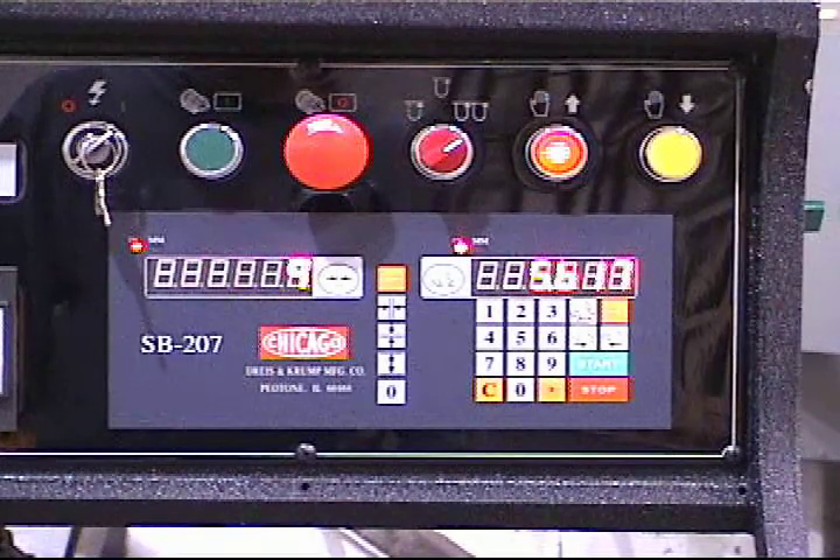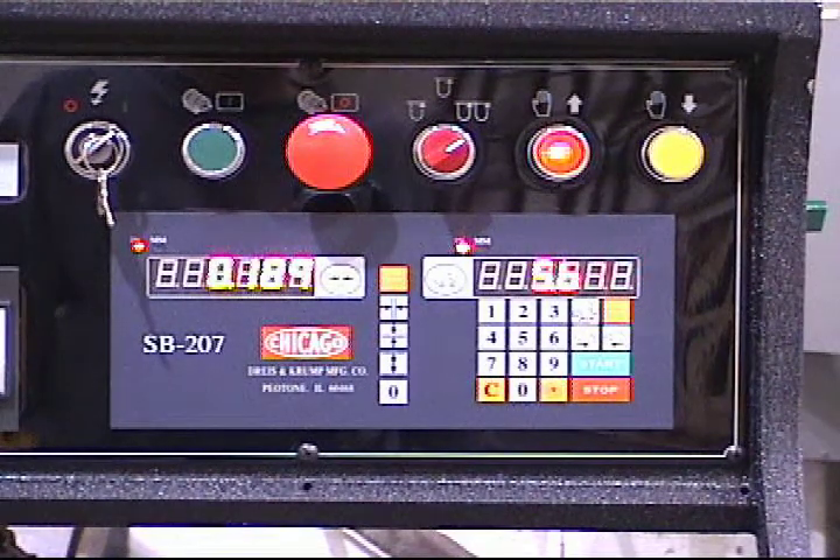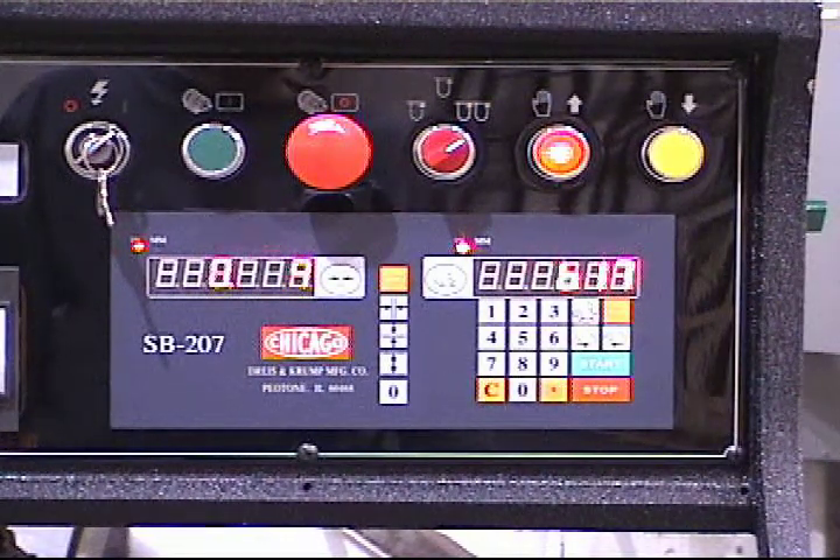On the left side, 0.189 — right now is your blade gap readout, which displays what your positioning is for your gap. On the right side is your back gauge position. It's got go-to positioning, and it's also an inch or metric readout.